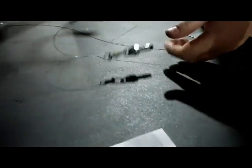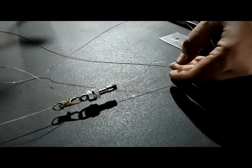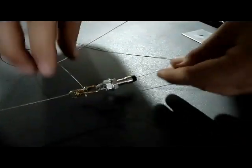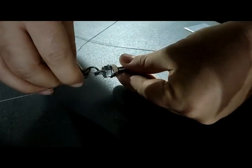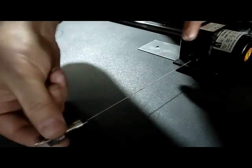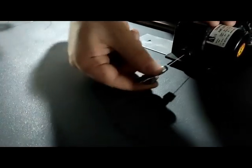Here in this section I'm showing you how to calibrate the pallet tester. Before starting the calibration procedure, first release these clamps from wire encoders. As I said, don't release this wire suddenly because it will damage the wire encoder. I'm releasing it and moving the wire slowly.